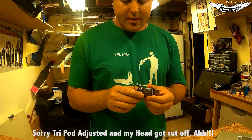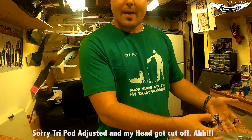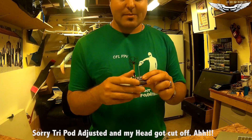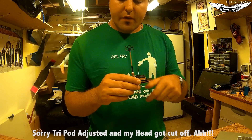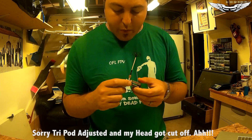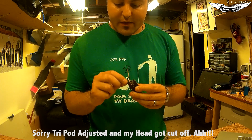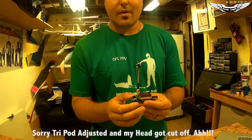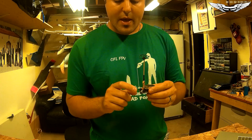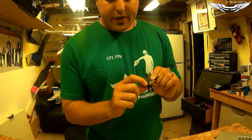My initial thoughts on the new modular system: it's pretty cool, actually. It's very versatile — you can plug this into your laptop or ground station and capture your video directly from there, using your laptop monitor as a display device. One thing I noted is this module gets very hot when plugged into USB — I had it plugged in for about five to six minutes and it was pretty warm, so make sure there's proper airflow over both devices. The build quality is pretty good — it's got really nice solder points, no sloppy soldering. The buttons are easy to push with a good response feel, though they feel a little bit weak on the board, so be gentle with it. The 3.5mm video out cable I'll test in the next couple of days. The LED is a great touch so you can see what channel you're on. I'll also figure out what that little modular slider is for.